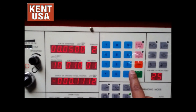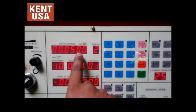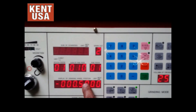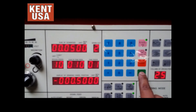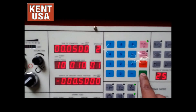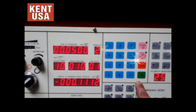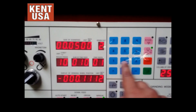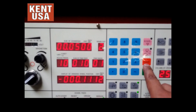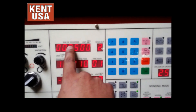On this section here we have our keypad. This first button, if we select it, will enable us to put a value on this side of the screen, which is the DRO. We can cycle through it with this green button. This next button here is a shortcut to fine-feeds. The next button is just a clear button. This is just a cycle between the DRO screen.